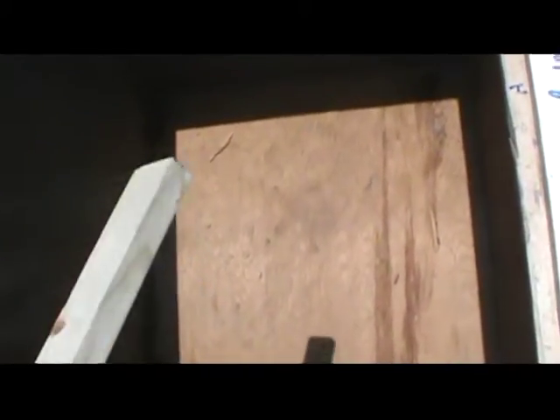We've completed the rough framing of the box. For your bottom, the overall dimensions should be 23 and a quarter inches by 23 and a quarter inches. For two of the sides you need 21 and a half inches by 21 and a half inches, and then the other two sides need to be 23 by 21 and a half inches.